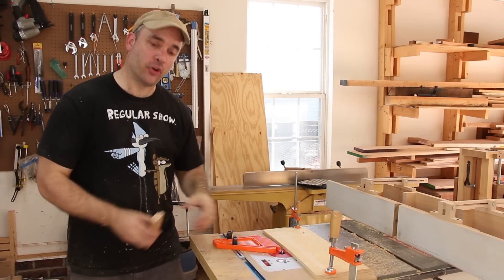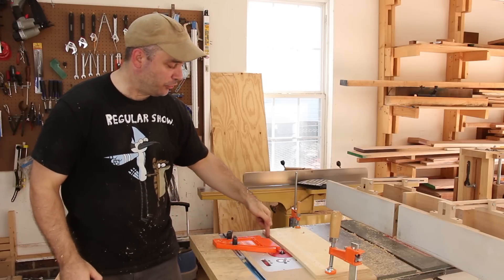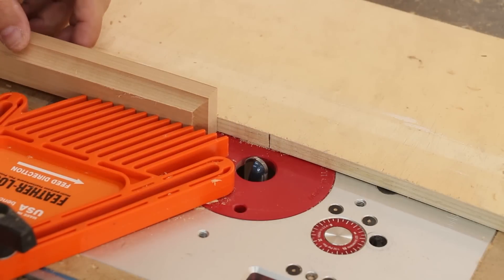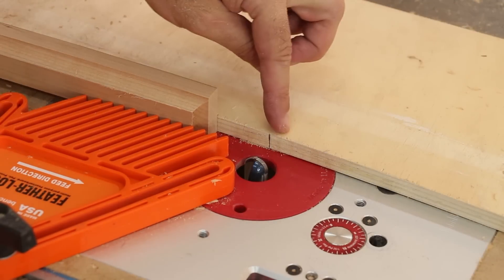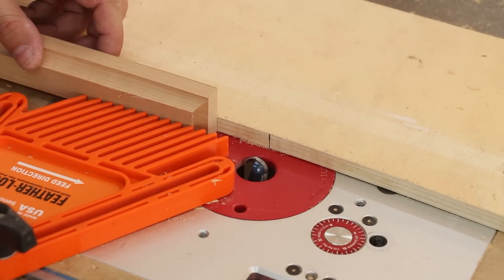With a five-eighths inch diameter round nose bit, I'm going to finish the finger recess in these arch pulls, using my concave fence to do this. Because our router bit is spinning in this direction, we need to feed our stock in this direction as we follow the contour of the concave fence — being careful not to get our fingers in the way of the router bit.